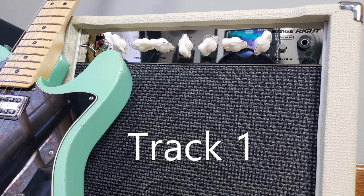Now let's add some gain — this is where I think we might actually notice some bigger differences. Clip number one was the stock tubes, clip number two was the aftermarket tubes. You could definitely hear a smoothing and higher gain. EL84 amps can be buzzy at higher gain, and you could hear a little of that with the stock tubes. With the aftermarket tubes, we got more power, more gain, and some of that buzziness was smoothed out.